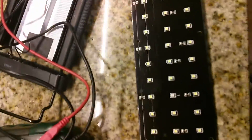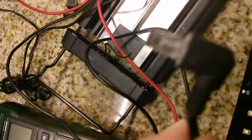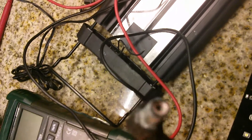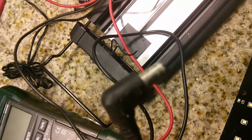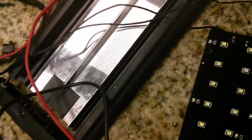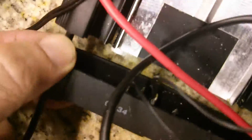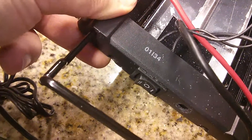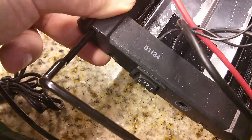The first thing I started doing is trying to diagnose a connection. The connection came in through this piece here from the wall, which is very eroded — it's full of salt, as you can see. And then it ended up going into this switch. It's a three-way switch because this board has two modes: one of them is blue lights only, and the other one is blue and white.